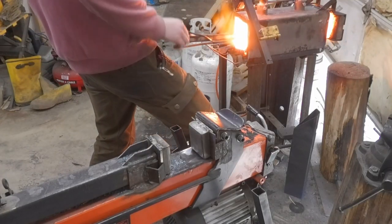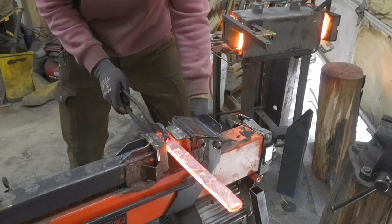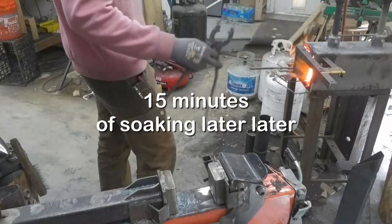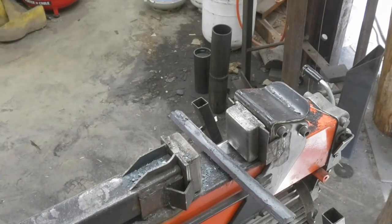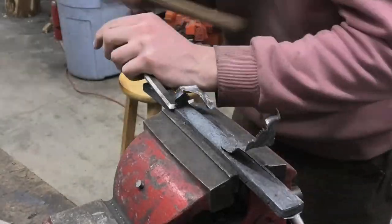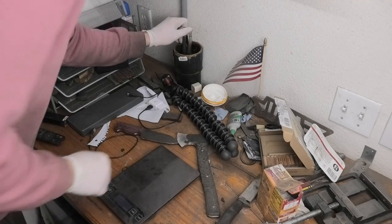Just know if you're sick of all of this welding, I am too. So you might have noticed that the jacket — the little sheet of steel — didn't weld onto the billet, which is great. Because the only purpose of that was just to keep oxygen out. So now I can chisel the whole thing off, grind it flat, grind it nice and clean, bring it up to a good finish. So now we can expose the final pattern, and I'll look because I'm sure there's going to be some welds in here that I need to take out.